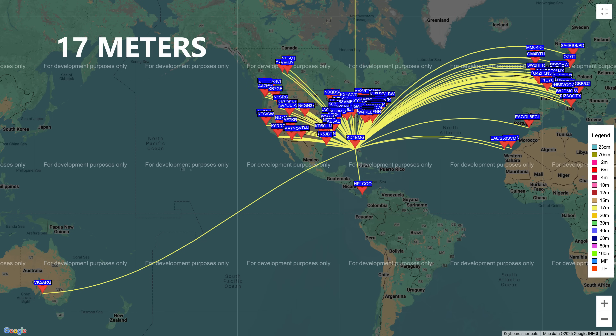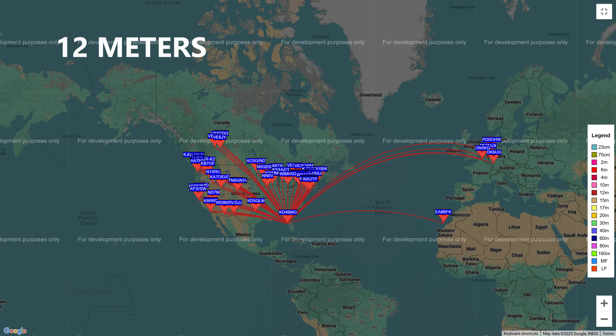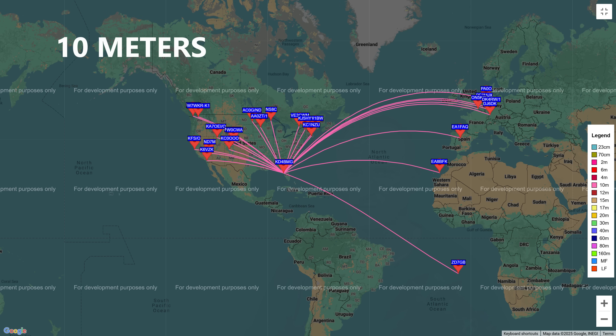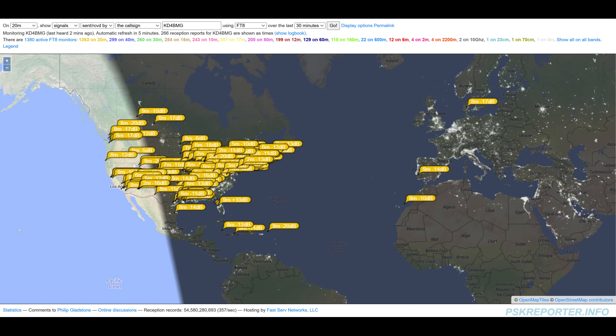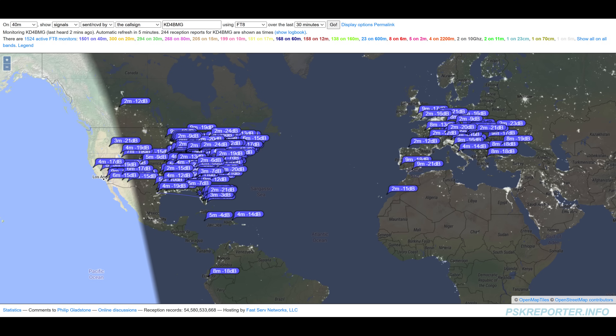The only band a little shy on reporting stations was 10 meters — that's because I had to take the antenna down before going to work due to a massive storm coming through. I missed the prime-time 10-meter conditions. One of the benefits of the MCOM-3 portable is right there in its name: size and portability. It's rated at 100 watts SSB, 50 watts CW, and 25 watts for high duty cycle digital modes like FT8. That didn't stop me from having great success on FT8 on 20 meters — within 15 minutes I made all the contacts needed to prove effectiveness. I jumped to 40 meters and found the same operating conditions.